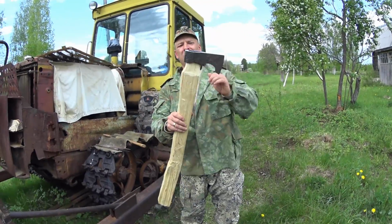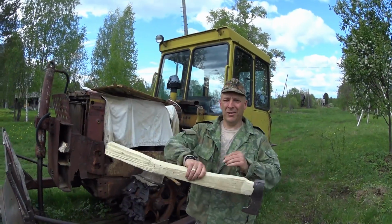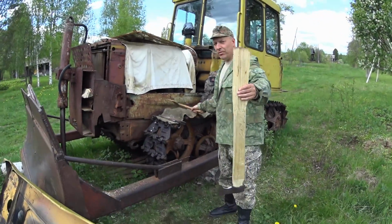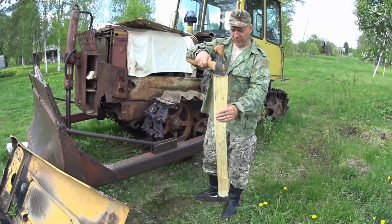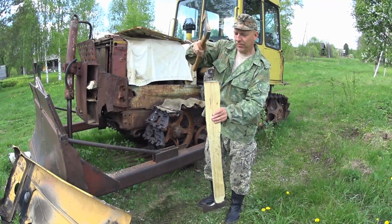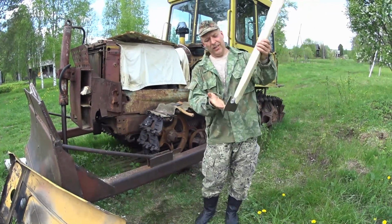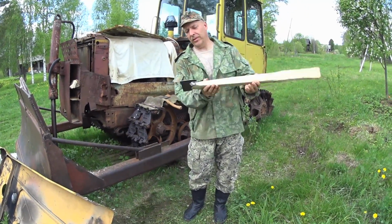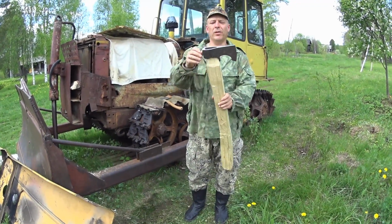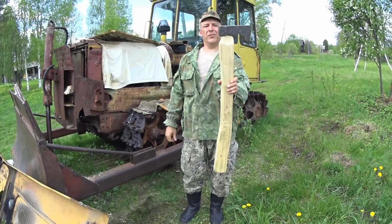When you have the head on a haft and you are trying to fit it, how you're doing it is you turn it around and you lock it from the top here. And then the head works its way up. We're about halfway through, and I want a centimeter or something extra on top for the wedging.